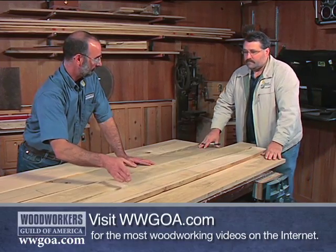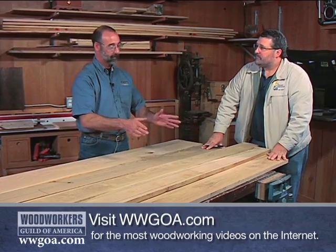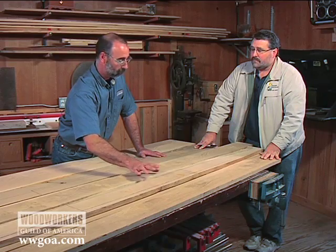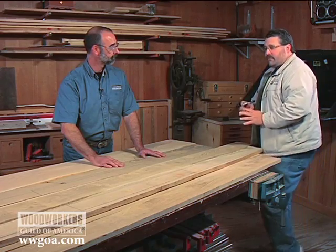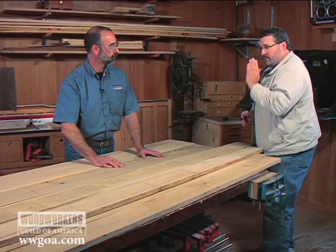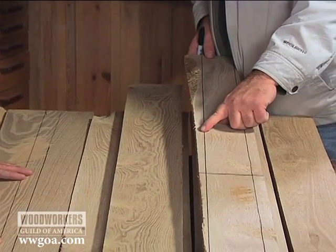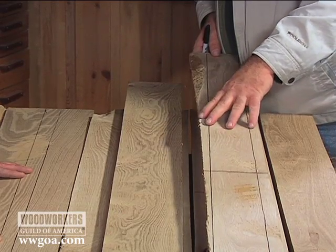Now, on straight line edging, I've seen your machine. It's pretty cool. It's got lasers in the whole thing. So just give us the walkthrough on if your guys were cleaning this board up and they were going to straight line edge this, what happens there? We basically use a multi-bladed saw. We only leave one blade in there with a laser on it, and it shows us exactly where that blade's cutting. We will hand feed in every board, and we will clean up and leave as little waste on our floor as possible, so that you end up with the most yield out of your lumber.